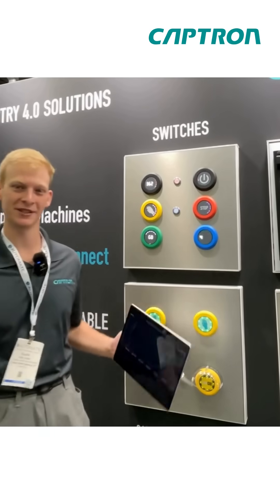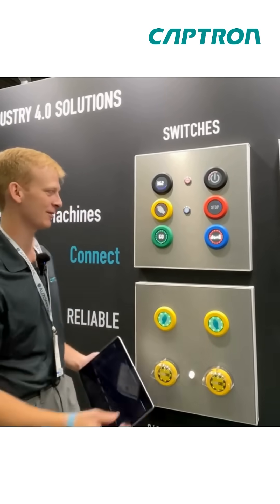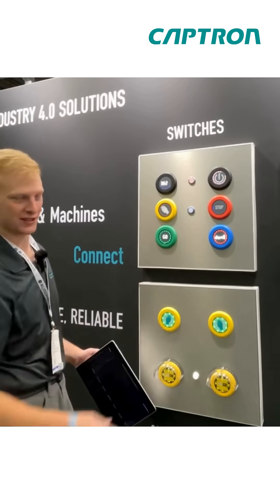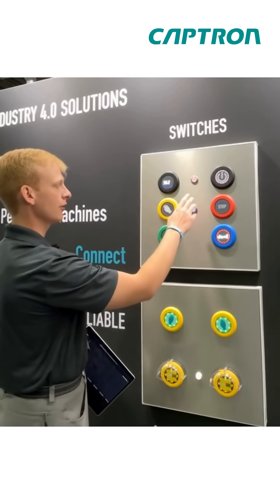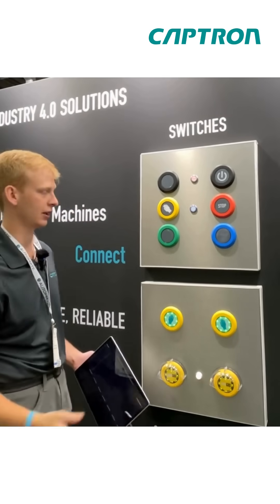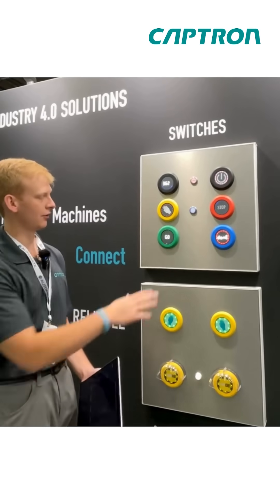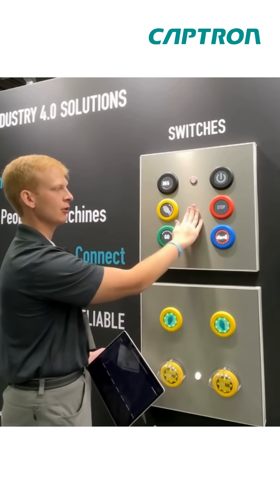And this is supposed to give you the time, but I'm obviously not the greatest ladder logic programmer, so it's not very accurate, and then the demo resets itself. We also have two Neo 10s set up here, so that if I press the stop, it cuts the demo off, cutting the lights off, and a reset button. Another cool feature of the reset button is I can go through the demo and then click it, and I start from the beginning.